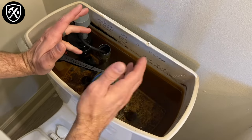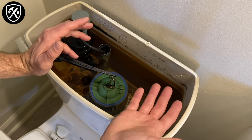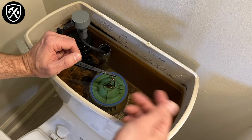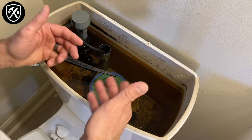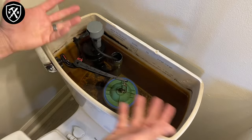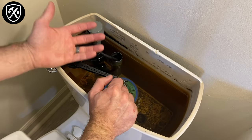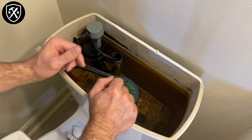Inspecting the rest of this — if you are taking the time to drain your tank and you do have a wet vac or shop vac that's able to vacuum water, or even just a sponge, you might want to clean out any sediment in the bottom of the tank. In this case we've got a lot of calcification over time, so when we go to grab the fill valve seals we're gonna keep a whole package on hand.